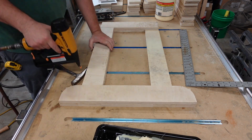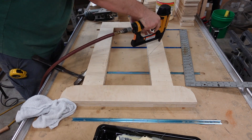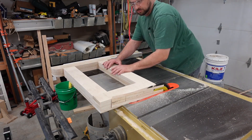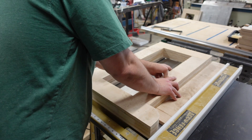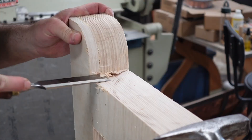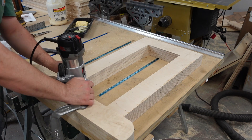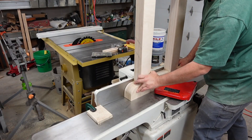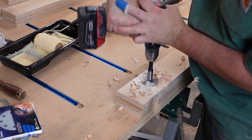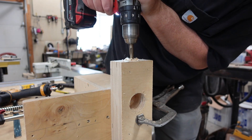As you can see, it's just a bunch of strips glued together and it really makes a strong base — they're interlocked. There's a flush trim bit, and now this is kind of an awkward cut, but making the base parallel with the top. You can't get these exactly in line when you're gluing them up. Also cleaning up those edges with the table saw and finishing what it can't do with the hand tools. A little roundover bit to soften up the corners. I should have used a zero clearance saw blade when I was doing that to get fewer splinters, but it's attached with bolts so accommodating for that right here.